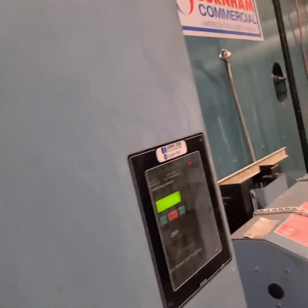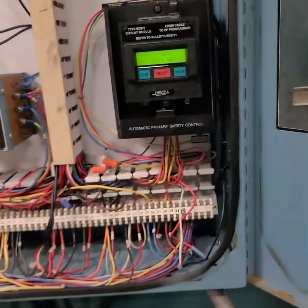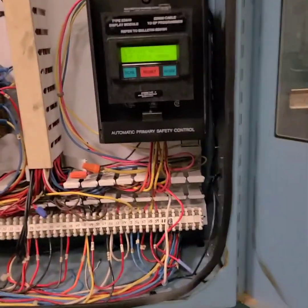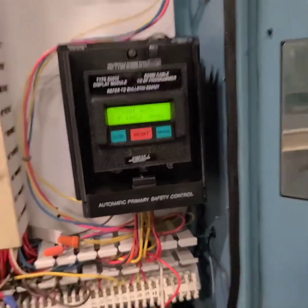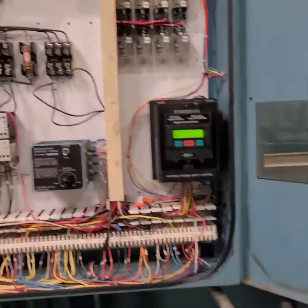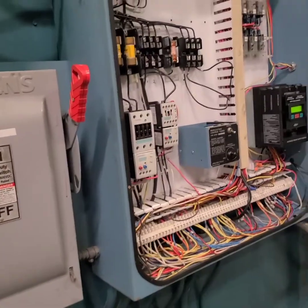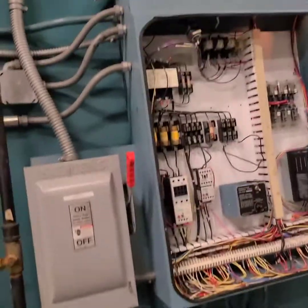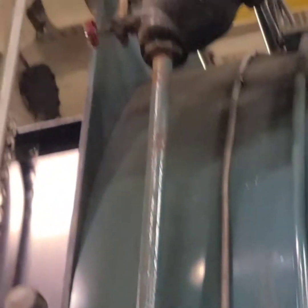Because it doesn't actually mean it has anything to do with the flame. The 3p interlock is going to tell you right there that it most likely has absolutely nothing to do with flame whatsoever. It's something within the 3p interlock, which could be anything depending on the wiring or the piece of equipment. I suspect it has something to do with this low water cutoff.